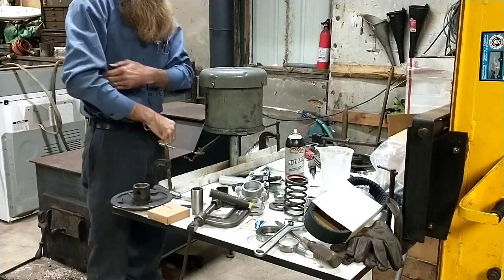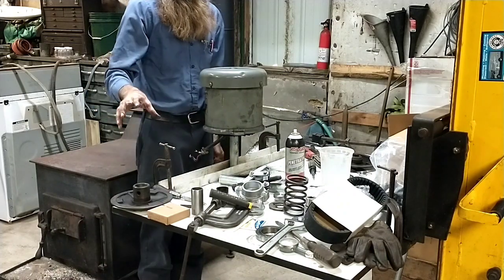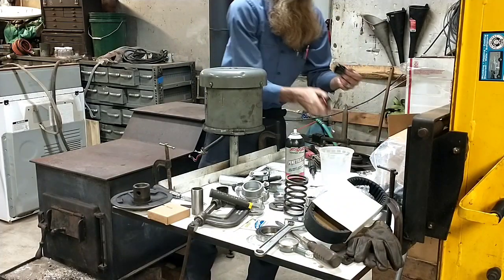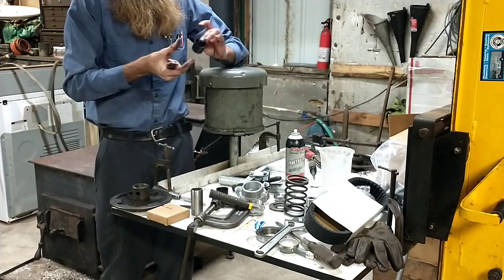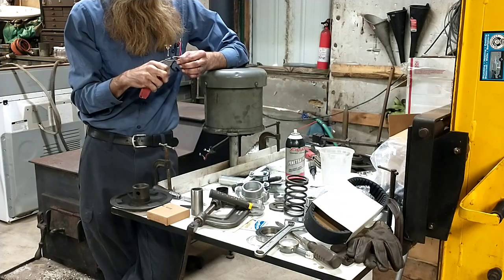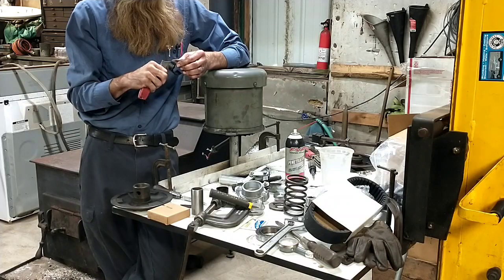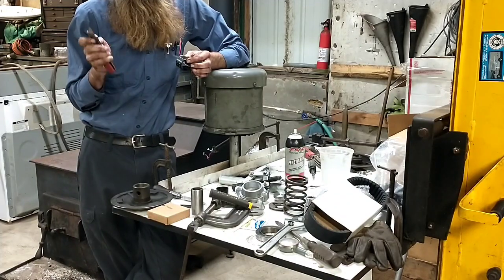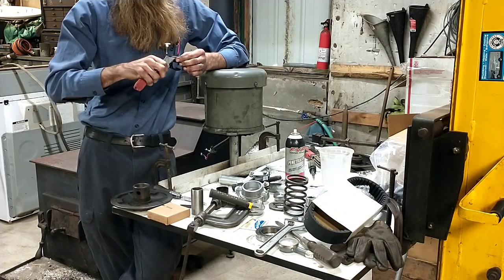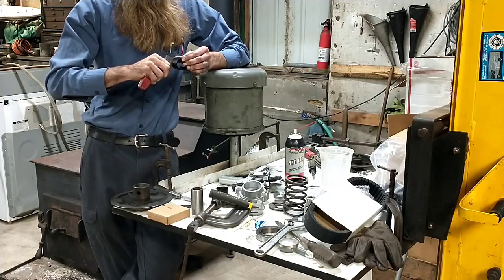Alright, and I should mention that pretty much everything you're about to see applies to either the motor pulley, the sliding motor pulley, or to the pulley on the spindle end of the operation. So when you get your new bushings, these things were injection molded, and they have a super slippery smooth finish on them. You want to take a nice sharp knife, in this instance a razor, and just shave down the sides of them. Get rid of that super smooth surface. If you don't do this, I guarantee you within the first week of operation, your bushings are no longer glued in place and they're rattling around, and you're well on your way to your next set of bushings going bad. So do not ignore this step.